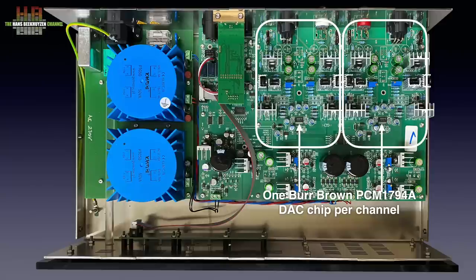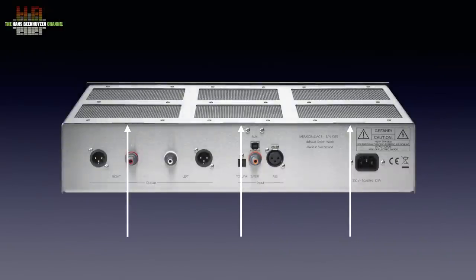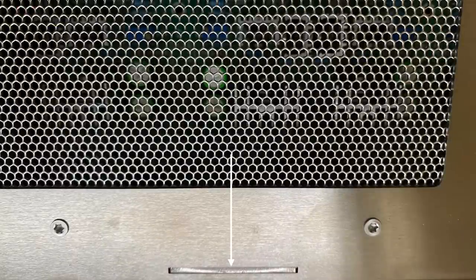High quality capacitors and transistors being mounted on miniature cooling profiles, very methodical PCB layout, it all leaves a high quality impression. I'll show you one more detail. The cover panel has slots in which raised portions of the front and the back panel slide. This makes the cabinet very rigid and tells something about the designer. Something good.